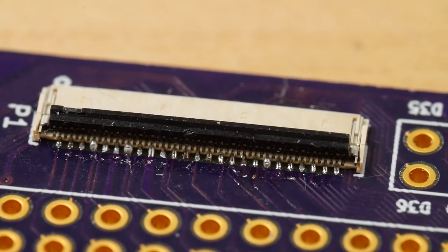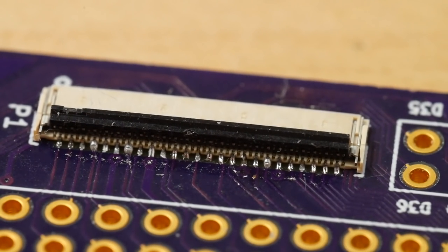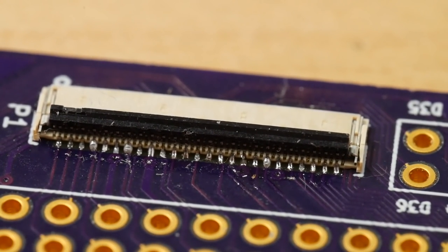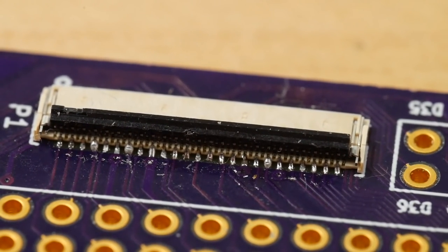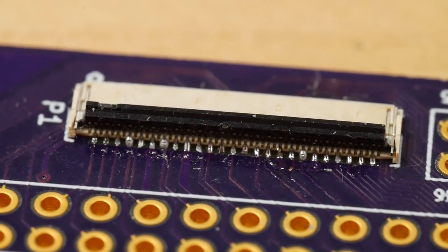Now, of course, it wasn't perfect. The leakage of the solder through the stencil is a problem. So I think in future, what I'm going to try and do is cool down the solder paste. Now, of course, it wouldn't be ideal to put the solder paste in the fridge with food, but perhaps if I were to put it in a sealed bag and then put it on ice for a while, that would do the job of making it a bit more viscous. But otherwise, I could not be happier with the results.